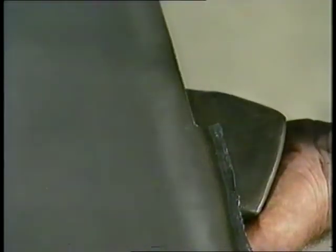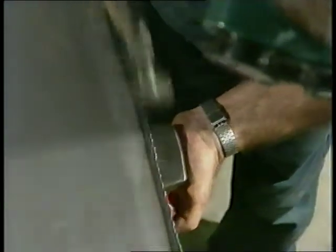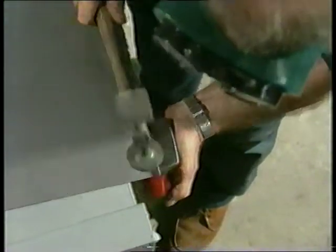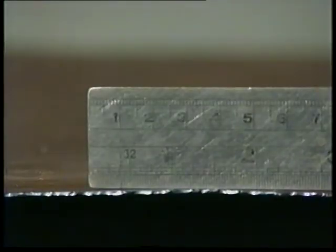Unfortunately, simply cutting out the distortion caused by heat is impossible in many cases. Hammering out the distortion is the other answer. Again, the work to correct the distortion takes place within the colour change zone, not outside this area. Bob hammers out another edge previously cut by the oxy torch, working thoroughly along the edge but only within the immediate heat affected area. Treatment of this limited area again removes distortion in both the edge and the sheet as a whole.